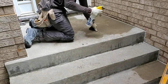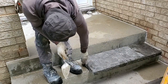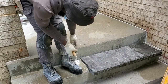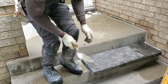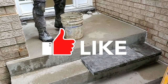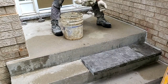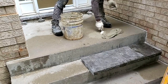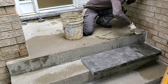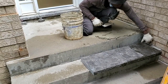We're just gonna go ahead and spray down our wall with some water mixed with bonding glue. So as you see what I did here, I put the cut right over there to the wall, so that we have the factory section turned the way that's gonna be more visible. The mortar that I'm using for this is a Mapei mortar. I don't have any Type S in it. It's just a straight Mapei mortar I'm using. I'm gonna go with around half an inch to quarter inch coverage of mortar on our stone.